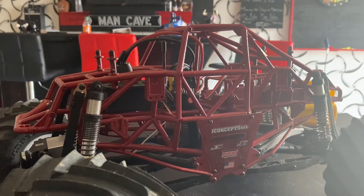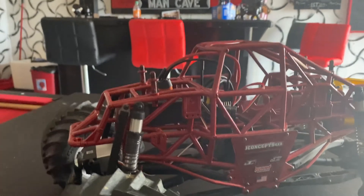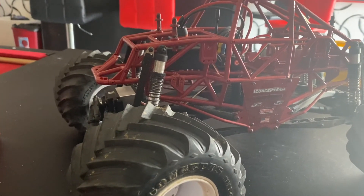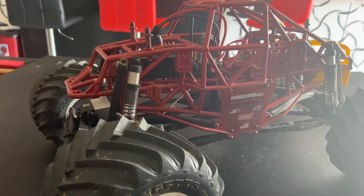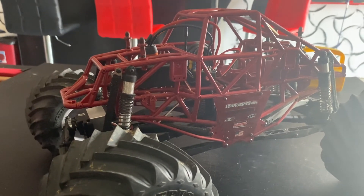I'm thinking it was a wiring issue — the wiring is too thin, too brittle. When you jump and it hits, it snaps from the soldering point. I kept wondering why it was cutting out every time I jumped, and even when I didn't jump it would just cut out. I got to looking at it and examining it a little better.